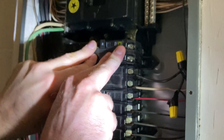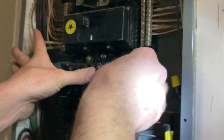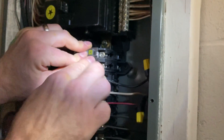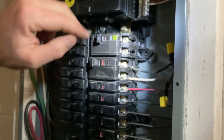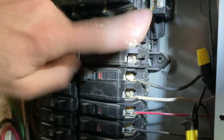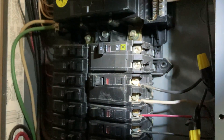It's tight. Now I'm going to tuck these in so they're out of the way. All we have left to do now is to install our 50 amp breaker, which is the whole reason we're doing this — to make room for that guy. We're not even going to hook anything up to it just yet because I don't have any six gauge wire; that'll come in a later video. Basically what I'm going to have to do is run another service to the outside of the house to accept the generator. But for now, this part of the project is done.